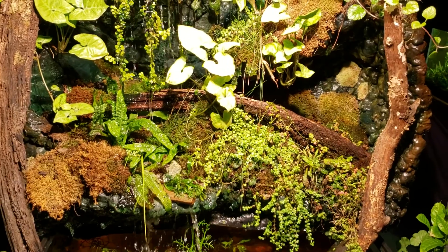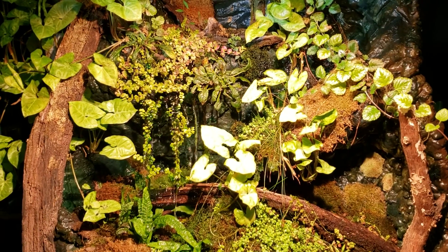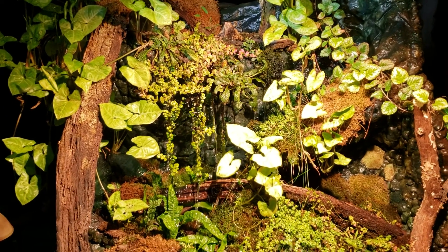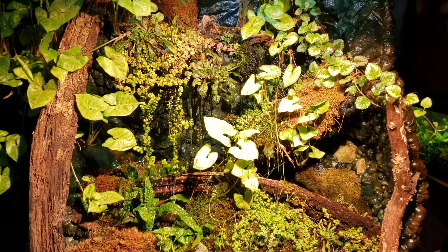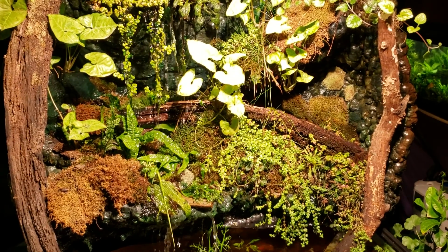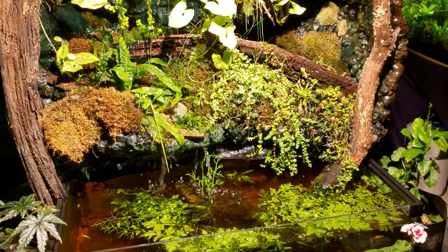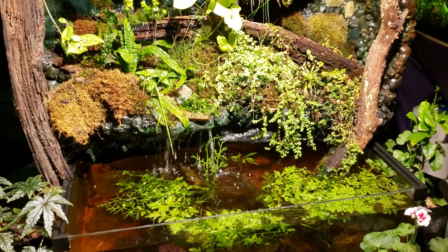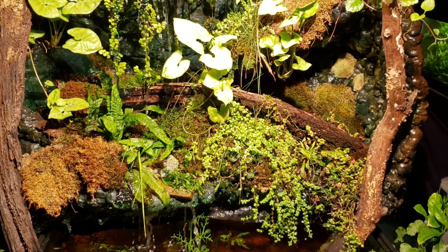They also have spotlights and floodlights, and they're all rated at 90-plus CRI. CRI tells you the quality of the light — it's a percentage, so 90 represents 90% of what natural sunlight would look like. The cheap Walmart bulbs I started with were 80 CRI, equivalent to overhead office lighting — cheap cool white bulbs, not very good but inexpensive and easy to work with.